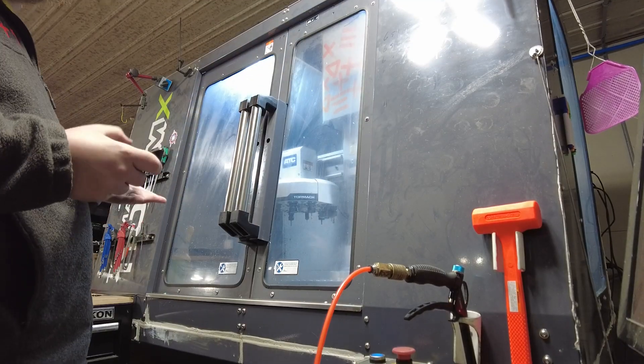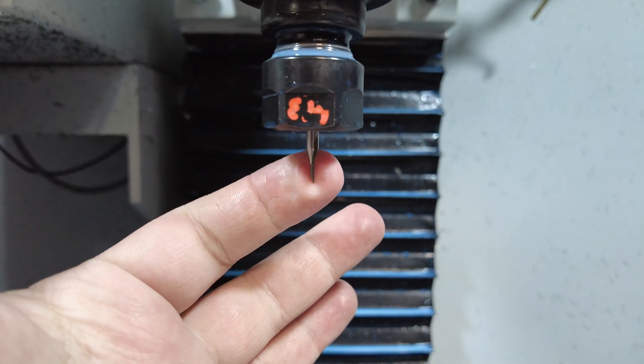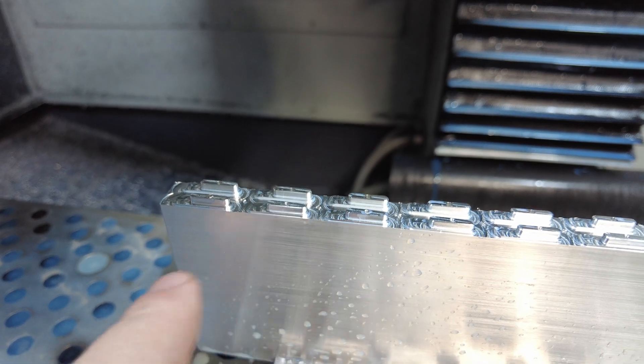We can start testing out if the automation on it works, and if it goes well, I'll do a run overnight and see how many we can make. We hit our first snag — we broke that itty-bitty tap. You can see it in the last hole right here. The other parts are still good, so I'm going to replace the tap and keep going. I don't know why the tap broke, which is a little bit annoying. I think even if I had been standing there watching it, I wouldn't have seen anything. I guess I'm going to try slowing it down a bit, but I don't really know what else to do there.